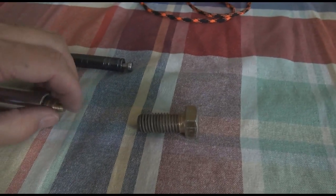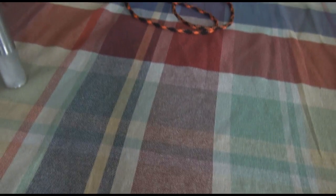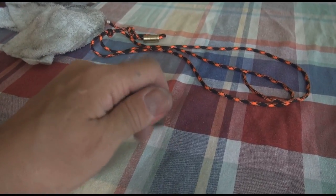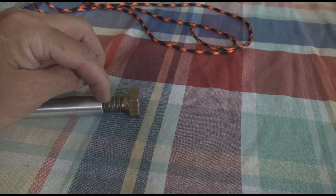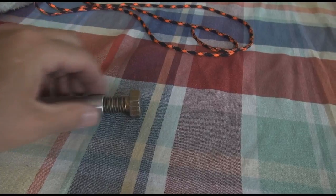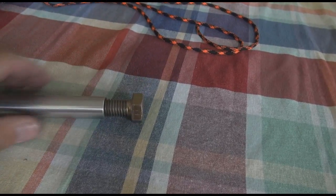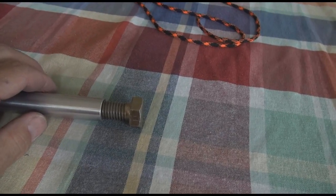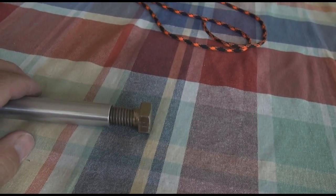You can see this is hollowed out — I need to polish it up a little bit. When this is all together, the point can fit so it goes in and threads down. What I'm going to do is cut this about right here, right at the end of the threads, then make a brass decorative end that threads down on this, lock-tight it, and then it'll have this sleeve threaded inside of it. I would normally just take the brass, hollow it out, and cut a thread, but I couldn't find a local die anywhere. I may change it later and actually get a die and thread it on the brass — but I thought, here's a way to try something and just see if I can make a little bit of lemonade out of it, with this grade 8 bolt sleeve threading in both ends.